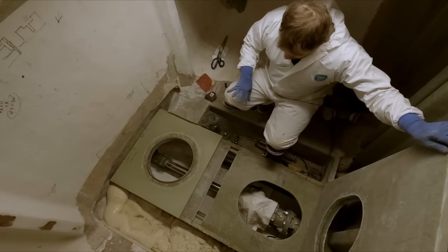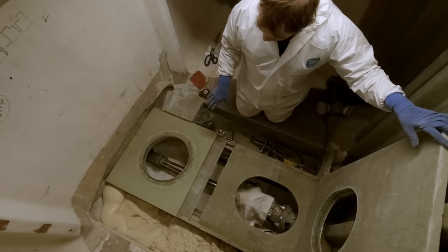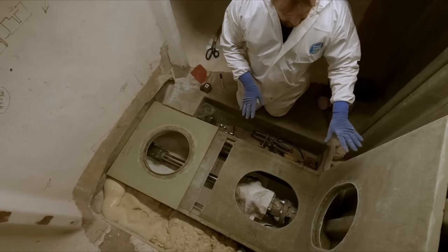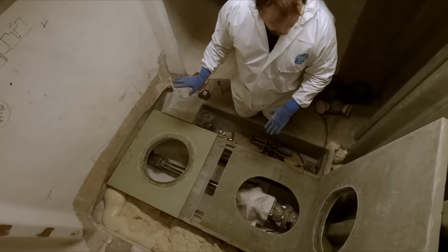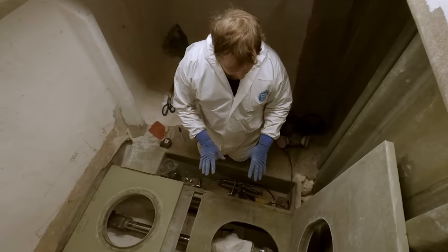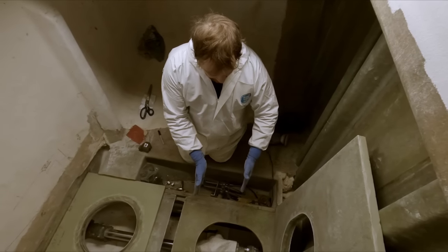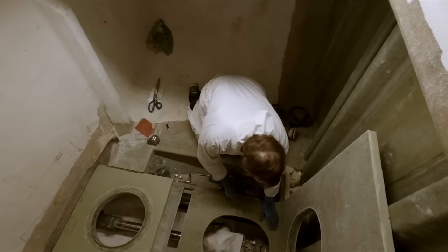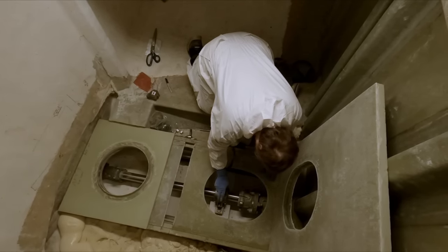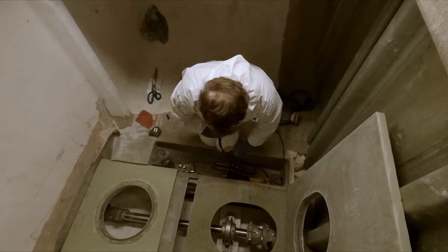And then this stuff changed a little bit over time as we progressed through this project and actually got the stuffing box installed and this coupling and bearing. All these holes in these panels were cut out a long time ago before any of this stuff was actually in. And so it's changed a little bit over time as we actually got this panel down here and saw where it was going to be in relation to the bearing and the coupling. We wanted to have good access to get in here and be able to unbolt this if we need to get in here and inspect this bearing, or if we ever had a problem with it, actually replace it.